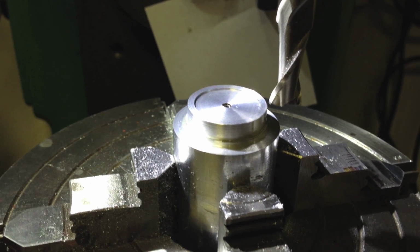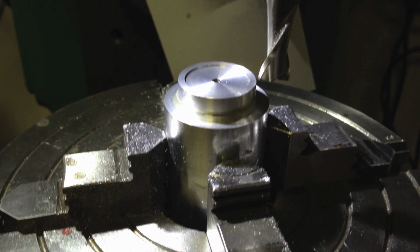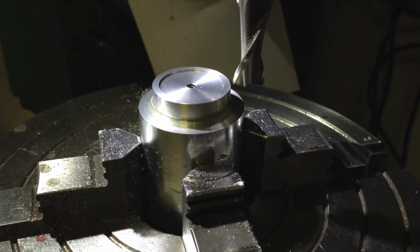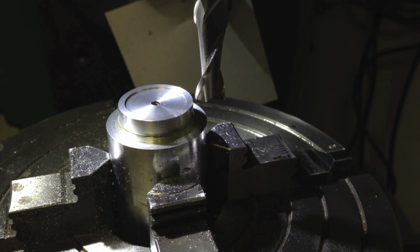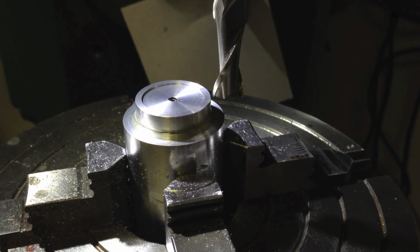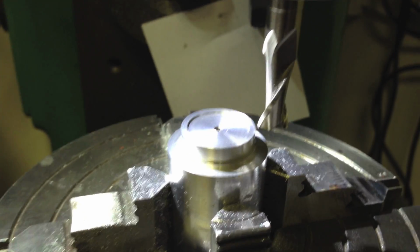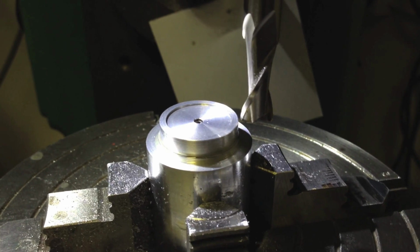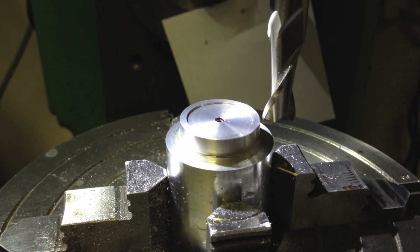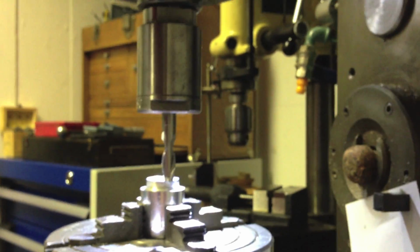equal to the depth of that recess, just to give the prism as clear a line of sight as possible up the eyepiece tube or the side arm of the microscope. So I'm going to set the camera down again around the other side, and I'm going to just find the edge. This doesn't need to be a very precision job. I need to mill a slot about 1/2 inch wide, straight in there. So I'm going to set that up now.